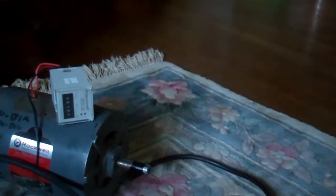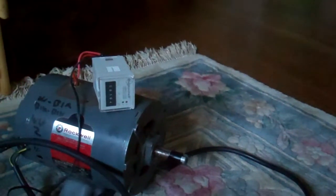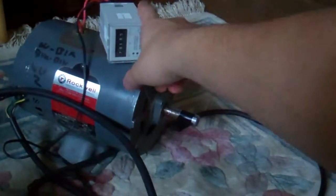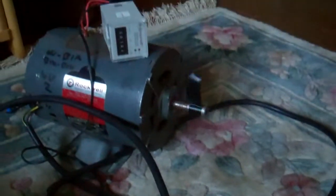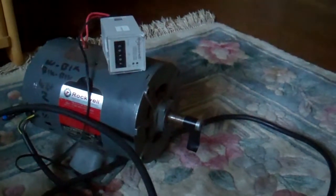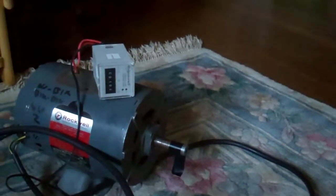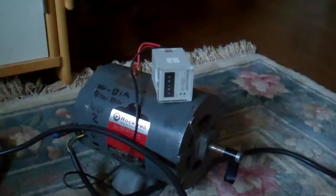This is the motor contact box I have a video of. When you push start, it'll start. This starts with the motor. While this is applying current to the start windings, then it'll start going, and after that time it clicks out with the relay, the start windings are shut off. After the start windings are shut off, it'll just run normally.